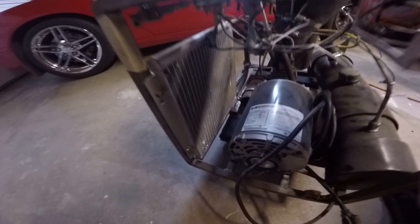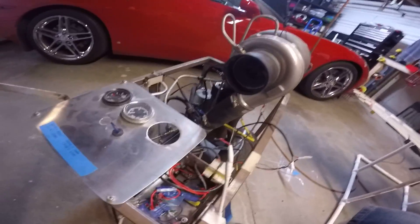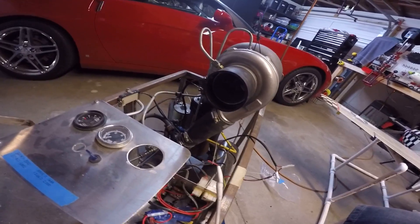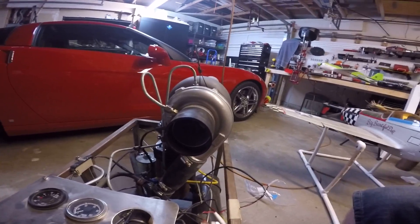For the pressure, I have a quarter horsepower electric motor here that I have coupled to a Procon vane type oil pump that is mostly used on carbonated systems off of soda machines. It's got a built-in relief valve that I've set to about 50 psi that provides a constant oil pressure to the engine despite the temperature changes in the oil.